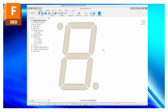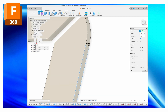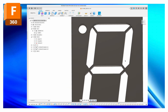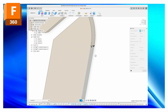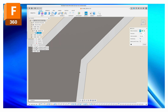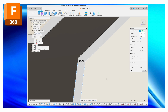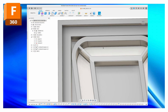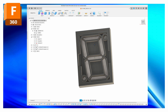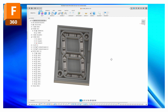I start, as always, by using Fusion 360 to model the mini display enclosure. The container will be made of black PLA and the segments will be made of white PLA with a thickness of 0.58 millimeters. I want to build a display with a very low thickness, with the printed circuit board attached to the back. I insert the LEDs and build a space around each segment to allow each pair of LEDs to diffuse the light only within its own segment.